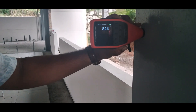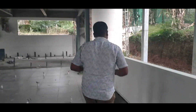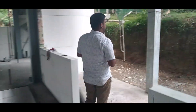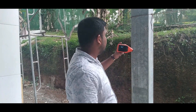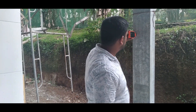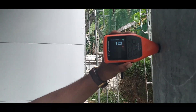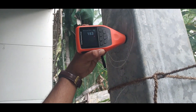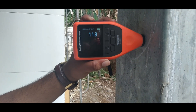Now let's go to find the thickness of the galvanized coat. This is a box bar — you can see there is no fire paint here. We can check the thickness of the galvanized coat. A reading of 123 microns is shown here. The average galvanized coat on this normal box bar is 150 to 200 microns.